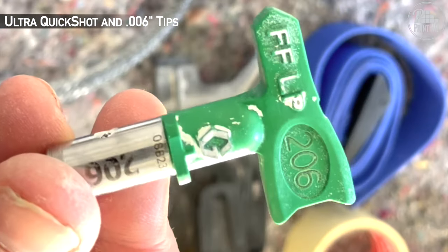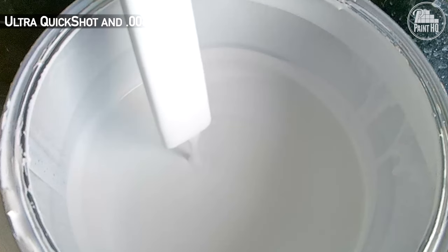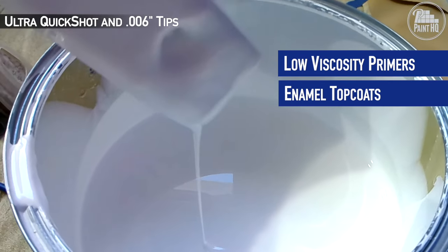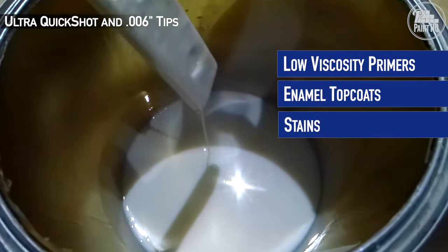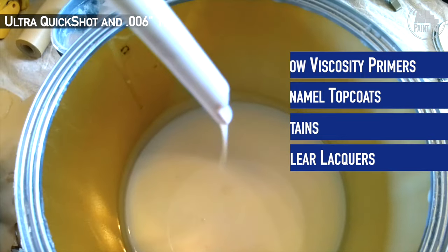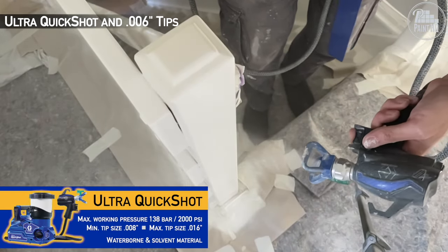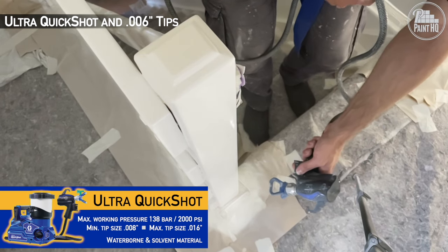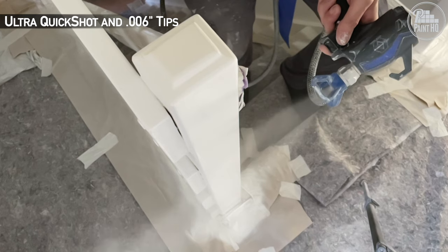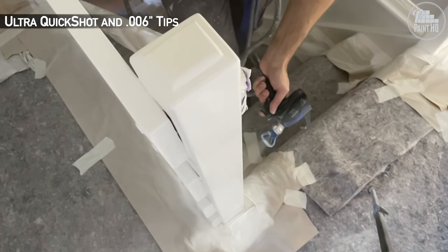One last tip: a 206 tip — six thou tips are for low viscosity materials where the paint flows off the stirrer and sinks immediately back into the paint. The Quickshot's minimum tip support is eight thou; that's the official answer. However, I've found a six thou can work, but don't over-pressurize the unit otherwise the prime valve will open at around 2,000 PSI to prevent over-pressurizing and preserve packing life. This low viscosity primer is atomizing beautifully, with control comparable to HVLP. You can tell if the prime valve is opening by the sound, and material transfers a bit heavier due to not atomizing fully.